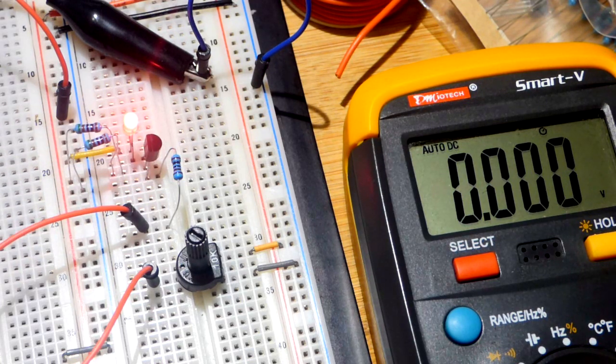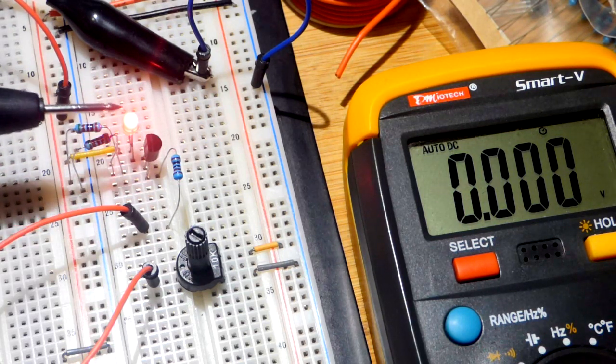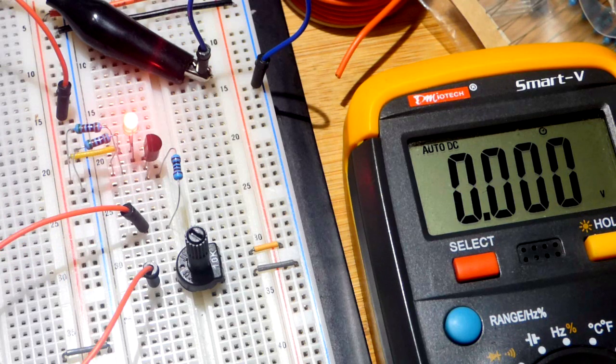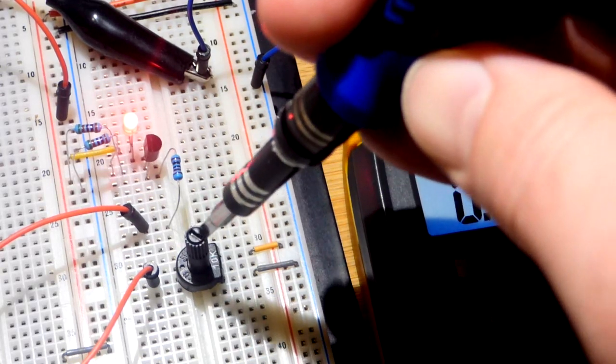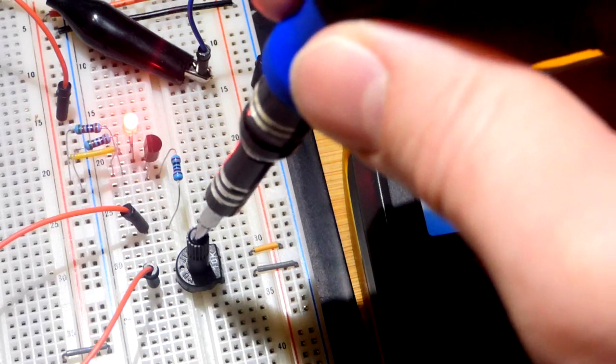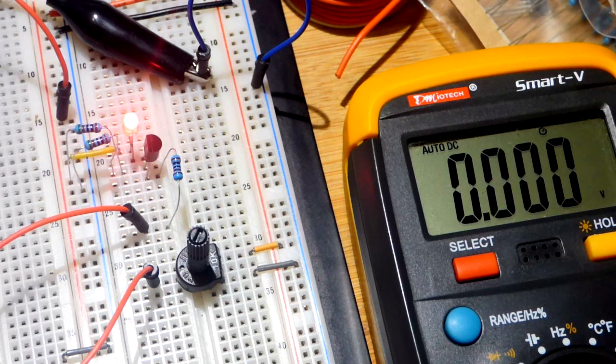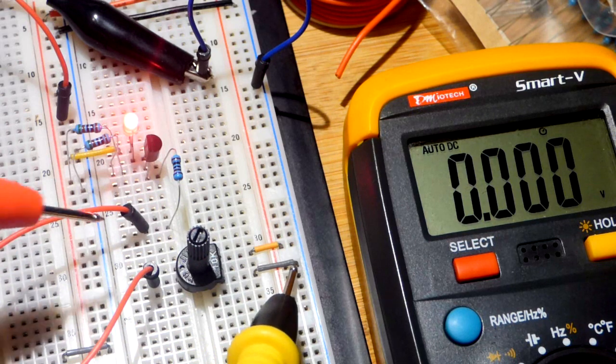For some reason it raised the voltage at the source, so they are not electrically isolated like the MOSFET — that is the main takeaway. There's N-type material from the drain and source, so it's not a great conductor but it is a conductor. There's P-type material at the gate, so when you have a more negative voltage it is reverse biased and no current flows. When it gets more positive enough, there will be current flow. We can see how much with this 1 kilohm resistor, which ensures it won't be more than 10 milliamps.